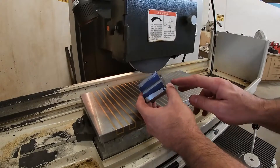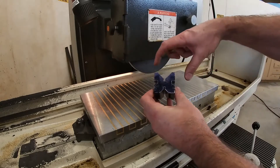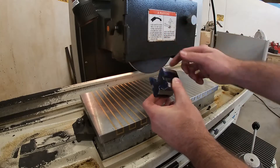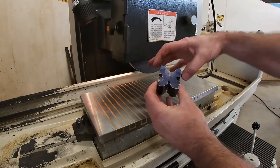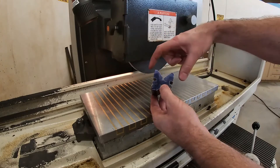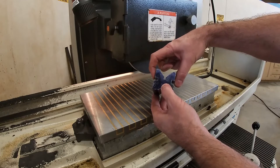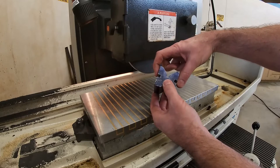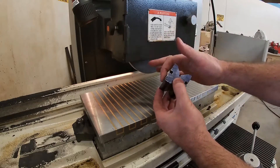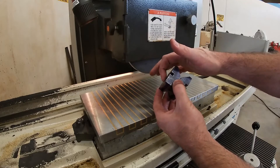Here at the grinder, the first thing I'm going to do is grind this side and then this side, so I know I have two surfaces that are parallel to each other. I just double-checked and this was my one inch 762 thousandths dimension side. I'm going to set the part down on the magnetic chuck, touch off, and then grind six thousandths off the first side.